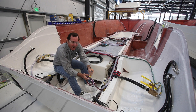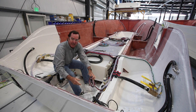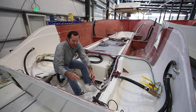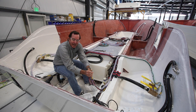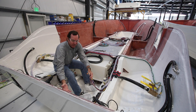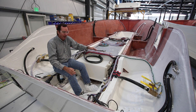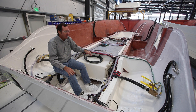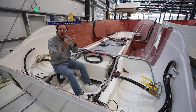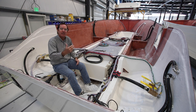All of these have Deutsch connectors so they can be plugged right into the accessory. If that accessory has any problem down the line, all you have to do is pull it out and pop the connector right in. These are watertight, so you're not going to have any saltwater intrusion, and they keep the electrical current absolutely perfect. There are no breaks in this harness as we move forward — everything is one straight shot. Those breaks are areas where you can have saltwater intrusion and current loss.